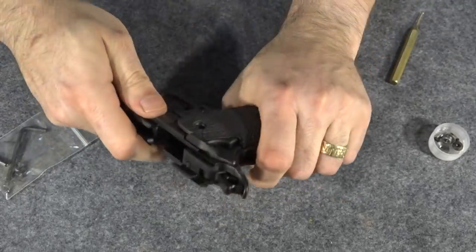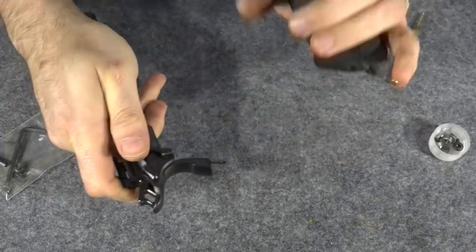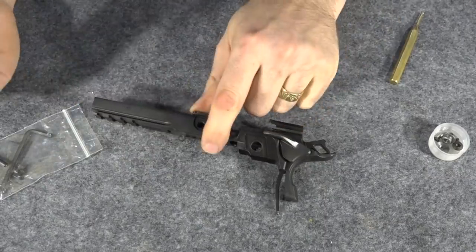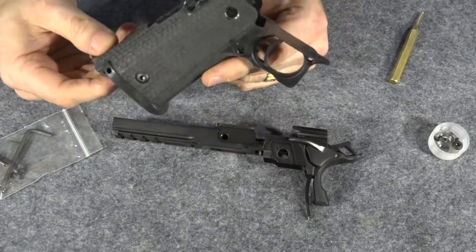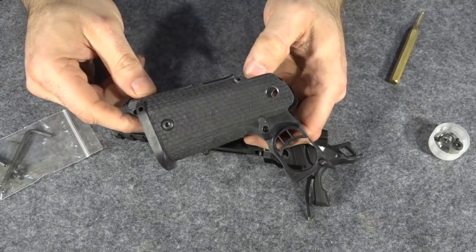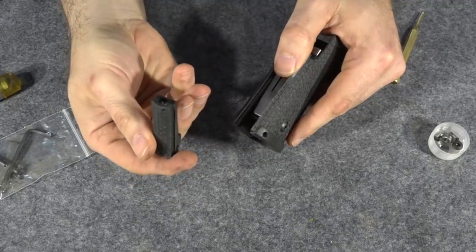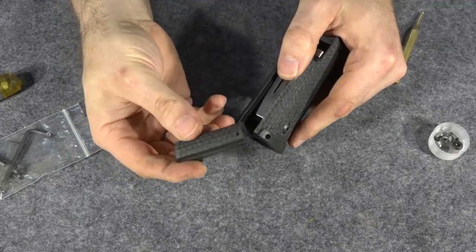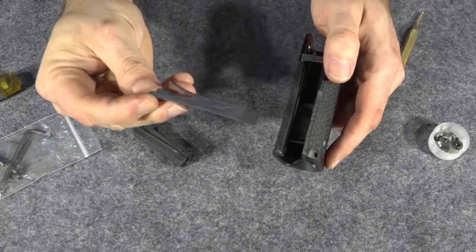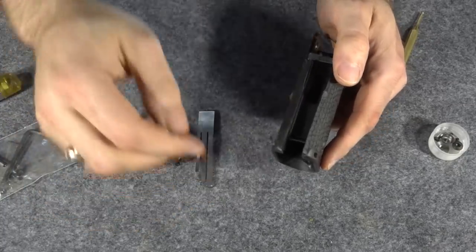That came out — I think that did it. It's coming off! It came off — there we go. We have the grip separated from the receiver. Now I just have to figure out what I need to take out of this grip and put into the other one. It's going to be like a 1911. I think I have to take out the little mainspring housing here and take the innards out and put them in the new one. And then of course there's the little leaf spring with three legs on it — that'll have to go into the new grip too.